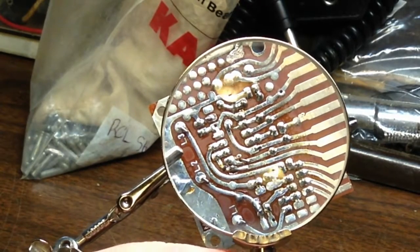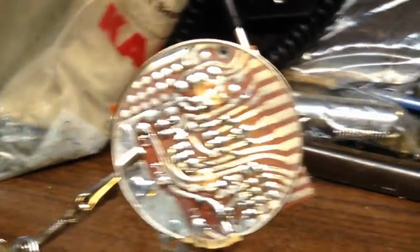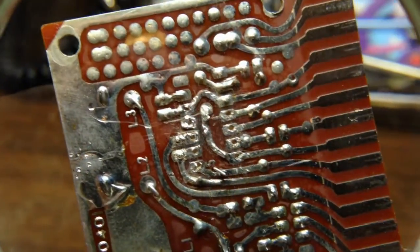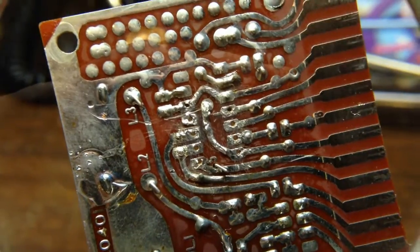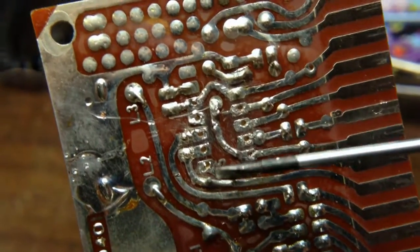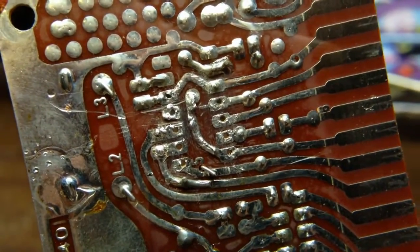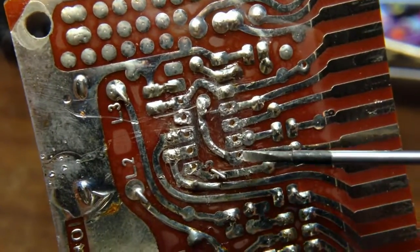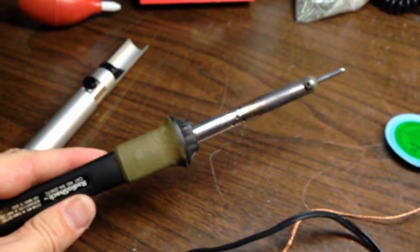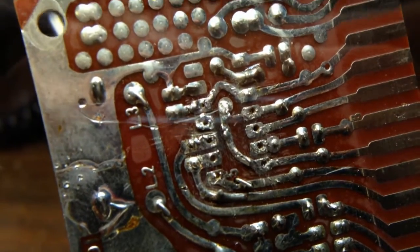You can see it actually has a little magnifying glass, so it gives you a better look. We're going to try to get this IC off without doing any damage to the circuit board - sometimes that's easier said than done. Here's the bottom of the board with the IC chip removed. You can see where the chip used to be. This is very difficult to do to begin with, but trying to film it at the same time is next to impossible - sorry I couldn't film the process. I ended up going with my small pin-size soldering iron rather than the gun, just to keep from burning the board.